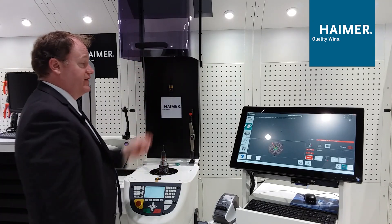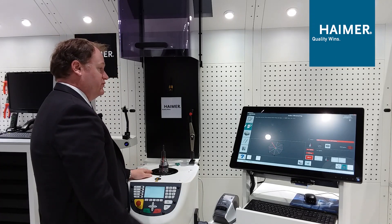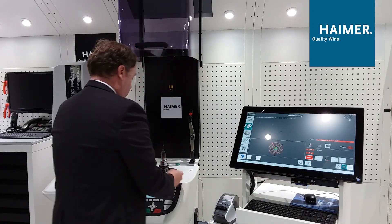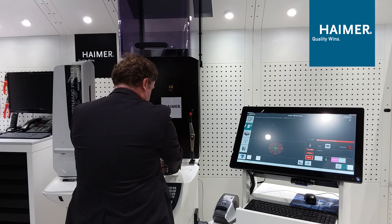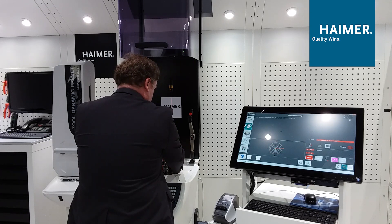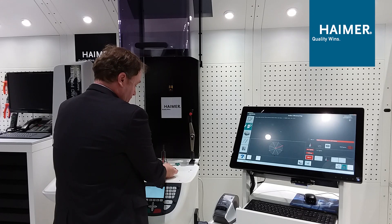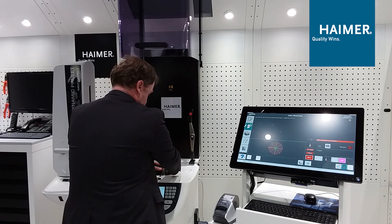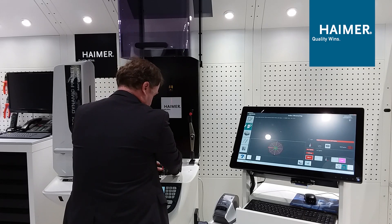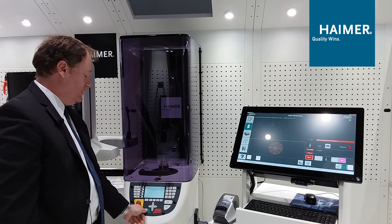As opposed to using screws, we're going to show balancing rings — a method of displacing weight to bring the assembly into balance. It tells us we're not balanced: we're at G2.5 at 5,400 RPM, but at 25,000 RPM we're at G11.3. It tells us where to position each ring — each ring has a known unbalance built in. There's a scribe line on the rings, and I loosen a screw then align it with the laser, which gets brighter when you're in the right position. We do this for both rings, then lock them down.